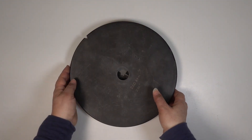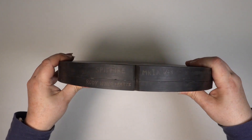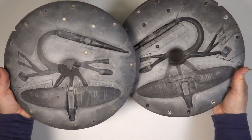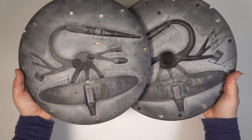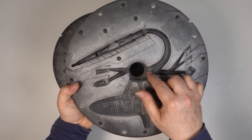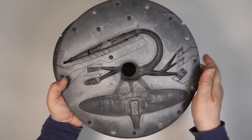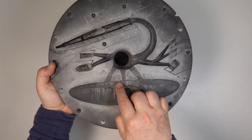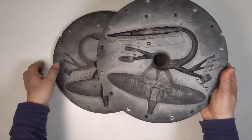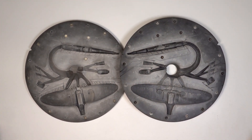This is a typical 12 inch diameter mold, in this case for a 1:48 scale Spitfire Mark 1. Once in the casting machine the mold is spun and molten pewter is poured in through the center. The metal then flows out through centrifugal force along channels cut into the mold by hand. As the metal flows in, air is vented out through smaller channels. This is the same principle as for the cold cure silicone molds.